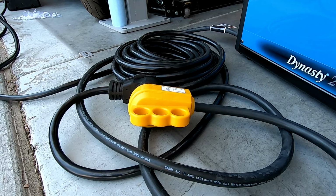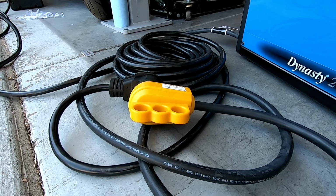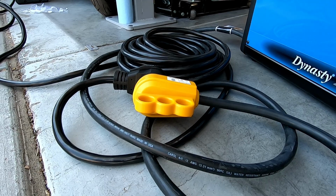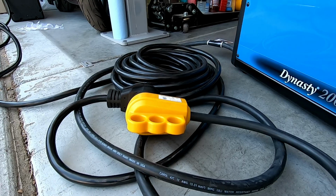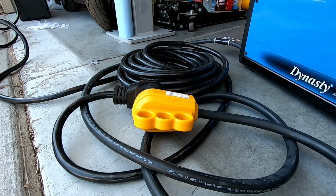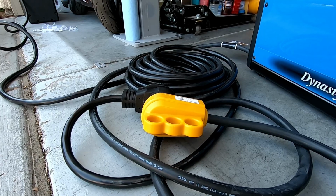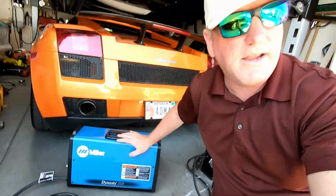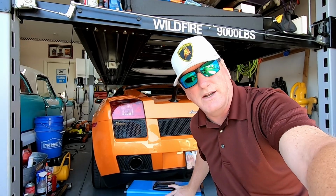And remember, you can use this for multiple things. These are kind of like a standard RV extension cord, and also good for a generator. Not that we really have that many issues out here, but you can always hook this up to a generator, reverse feed your panel, shut off your main and just have the breakers on that you need, and you're pretty much good to go for powering your house up, off of that or natural gas or whatever.